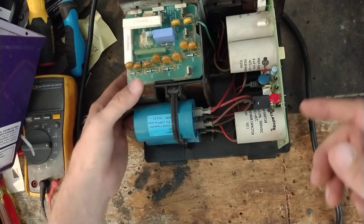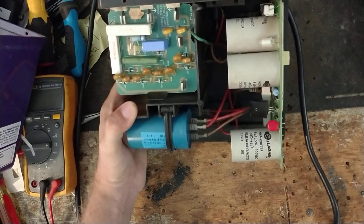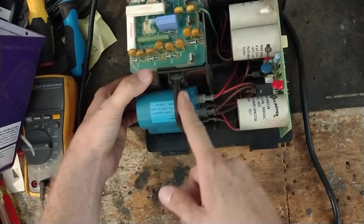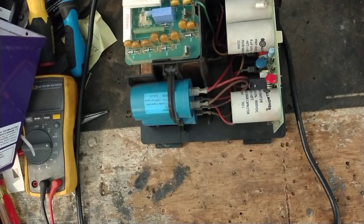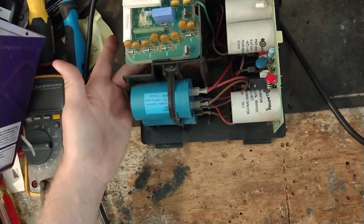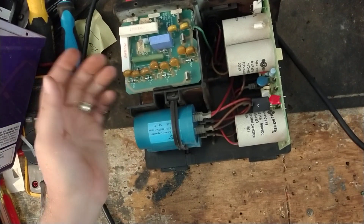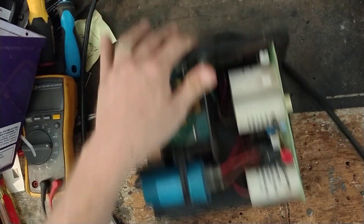There's a timing mechanism on the board. Some use a chip, some use trigger devices — SCRs, thyristors — and that's part of the timing circuit to tell it how often you want this thing to pulse. It actually triggers the energy out of these capacitors, goes back through the board and over to the transformer. So it takes that 600 volts DC and high amperage, and when it discharges and snaps, that energy goes through this transformer. The transformer takes that energy and turns it into about 11,000 volts out of the transformer itself — a higher voltage, lower current — through this output board and then out to the terminals for your fencing ground.